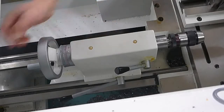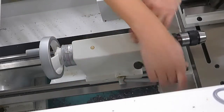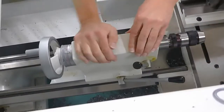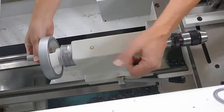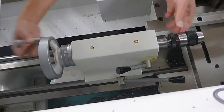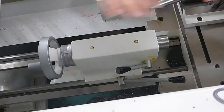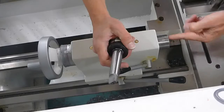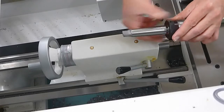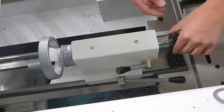This is our tail stock — it has two levers. This lever here locks the quill so it doesn't move. This lever locks the whole tail stock from moving side to side. When it is loose I can slide it; when it's tight it's locked. I can move the quill in and out. To remove a chuck or center, just back this up until it pops out. When reinstalling, make sure there are no chips on the surface or inside the quill. Engage it and rotate until the tang is seated up inside, then give it a little tap to hold it in place.